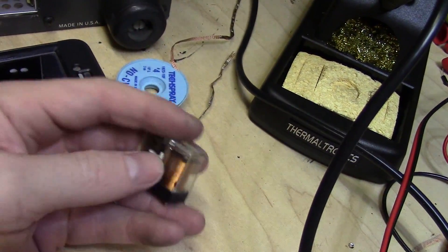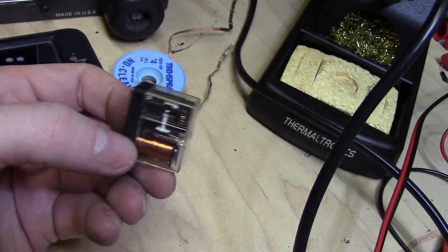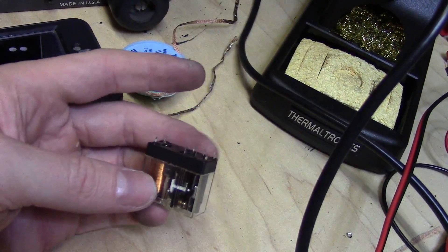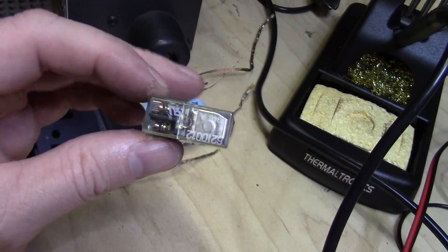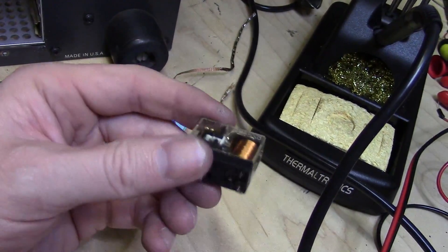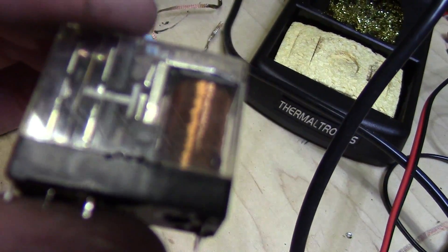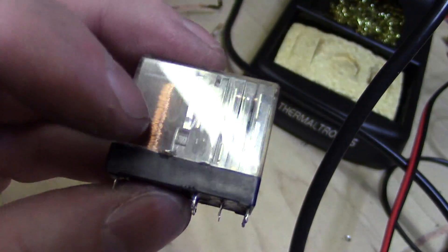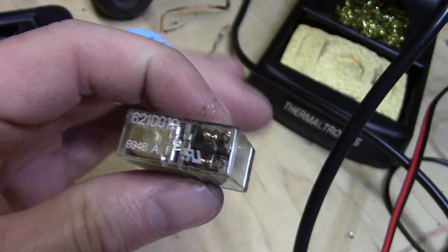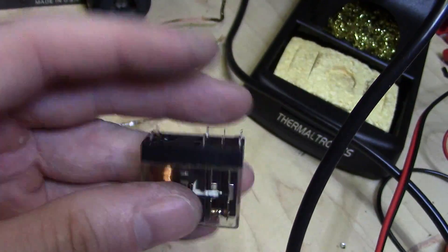We've found one of the culprits. This particular relay is a 12-volt — I believe it's either 3 or 5 amp. I was only able to find one source so far; I think RF Parts has these in stock. If I need to, I'll actually create a little PCB and replace it. There are two of them in this board, and I noticed some solder flux that wasn't on any of the other connections on both of these relays. If you look real close, you can see where they've actually split — there's a break in the plastic. Someone's probably tried to clean this relay or had some trouble with it.